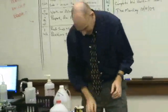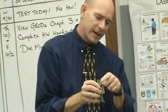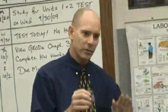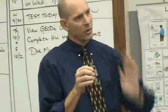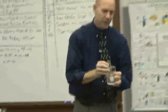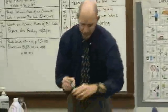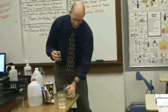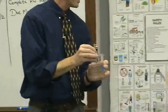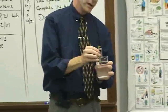There is another conductivity meter you'll use later in the year. It's got two little probes and a light-emitting diode. There's a diode in here that will shut off once it reaches a minimum threshold current. So a strong electrolyte will ramp up the current to that threshold, shut it off, ramp up, shut it off — so you get a blinking light in a strong electrolyte. That's a good conductor. In a lousy conductor like vinegar — a weak electrolyte — you should get a solid, steady light, since it's not quite reaching that minimum threshold voltage to shut off. And in a non-electrolyte solution like sugar water, you get no light at all.